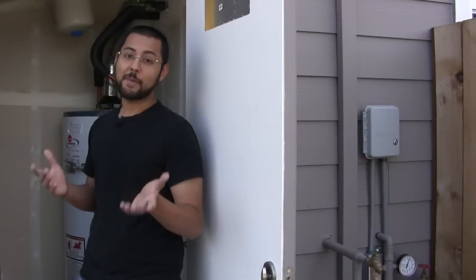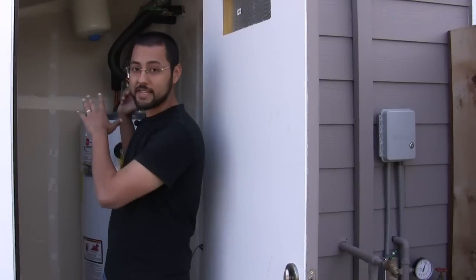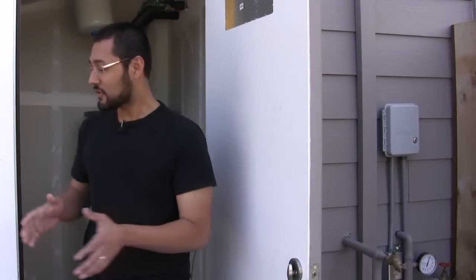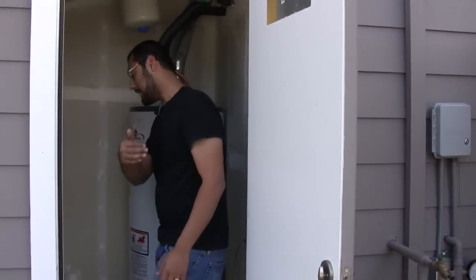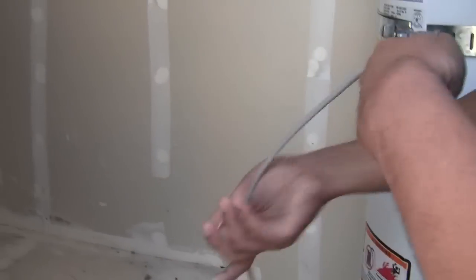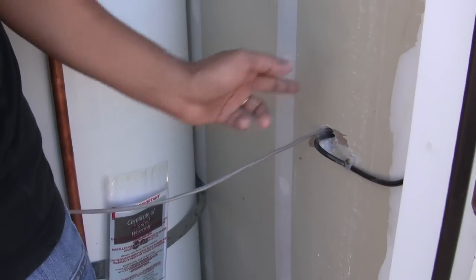We repeated that process five times so each cable had its own end and we attached them all to our switch. We did the switch end first so that when we go to the wall plates and put in keystones, we can make sure it works at that end too — otherwise you might not know which part doesn't work. Now this switch isn't connected to our actual network; there's no router in here. The router is actually in our living room. You can see this extra gray cable — it's connected to our living room router, and I still have to staple it up on the wall.